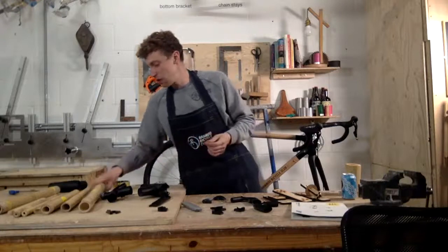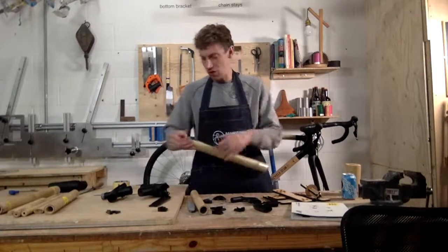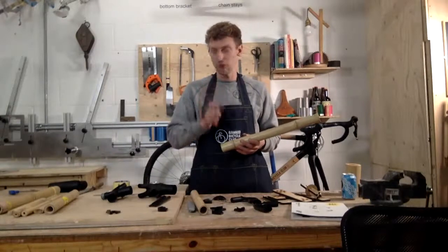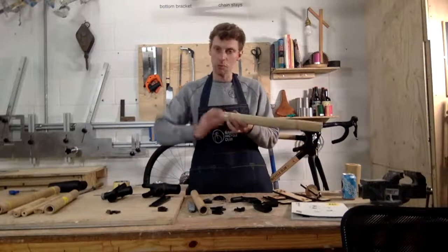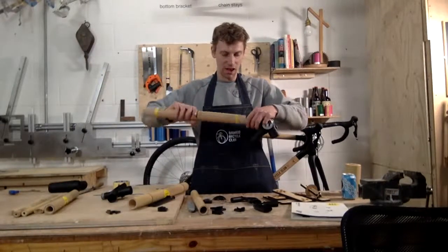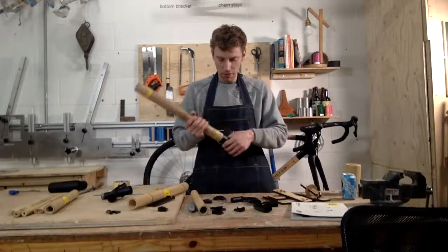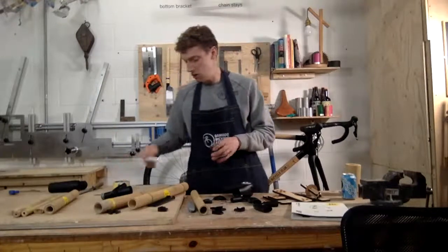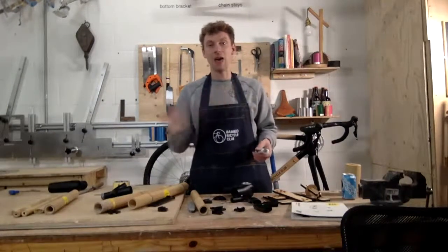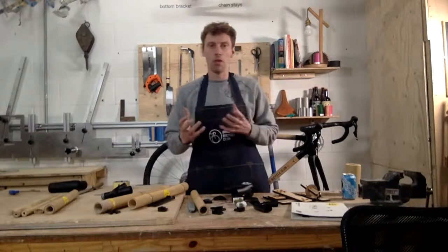The bamboo is specially selected and cut to length. What you need to do is improve the fit into the lugs — we're looking for a really nice tolerance fit, allowing about one to two millimeters of tolerance. You remove material from the bamboo so it slides inside the lug. I've got one I started earlier — you can see it sliding through; it's a loose fit but there's enough movement. Once everything is fitted, you need to use a structural adhesive — an epoxy resin. We spent quite a lot of time looking at different glues and epoxy resins on the market.